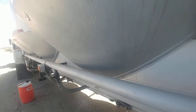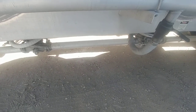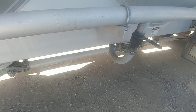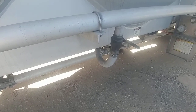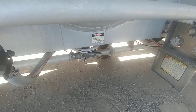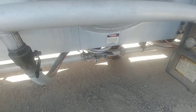So what I'll do is when I start putting air, 100% of your air now goes through the product line. Your tank is totally closed off, and then you're going to have high pressure all in your line, and then you rapidly open and close the product, and the high pressure will be drawn into the low-pressure tank, drawing some product out of the hose, clearing the line.